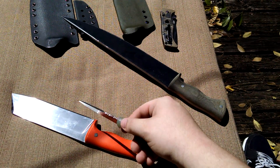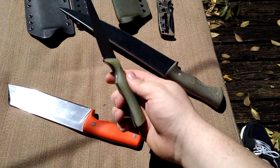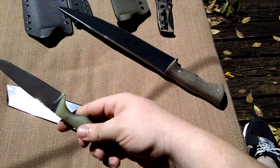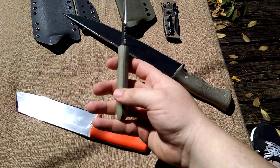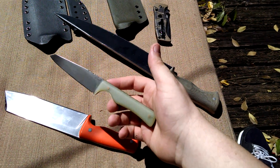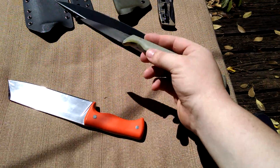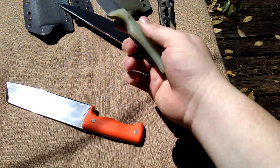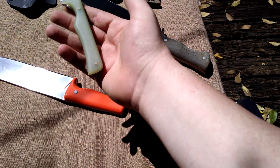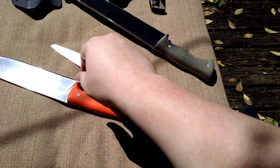M4 has good fine edge retention especially compared to its other high carbide compatriots like S90V, S110V, 10V, etc. Very nice steel, very nice execution. The handle is very well rounded with no sharp edges on all three of these knives - everything is flush, nothing to stick you, very comfortable in terms of ergonomics. Ergonomics are very subjective, but I suspect that these handles Kyle does would be comfortable for most everybody. The handle is affixed with two brass pins and I would assume epoxy.